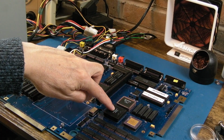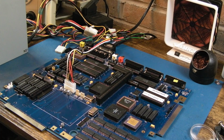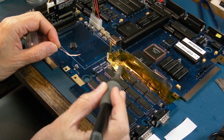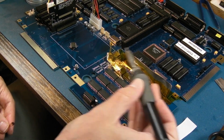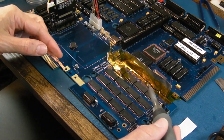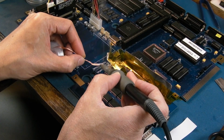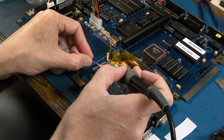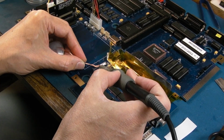And at the moment it's got the CPU where I wrenched that pin out and I stuck it back in and it's working. So yeah, I'm going to leave that on there. This board is just such a bodge. Right, so having tested pretty much everything I can, I decided I'm going to remove these first. If that doesn't work, I'll remove the first 4 that I'd fitted on here. Because we had a gal where it wasn't programmed right, which means the output enables and things could have been set wrong. In other words, this could have been outputting, could have killed this, could have killed that, maybe, just in the short period that I was actually testing, while things were not right with that gal. And I programmed up 4 new gals over there, different ones, from a different seller. They look more genuine, the other ones, they haven't got the boot polish on. So, I don't know, I'm totally in the dark.